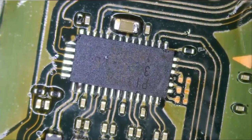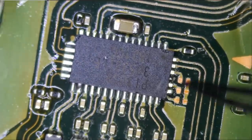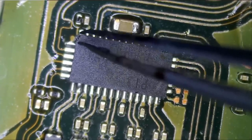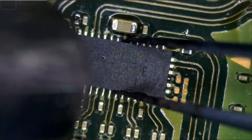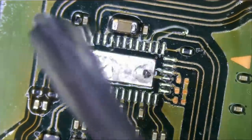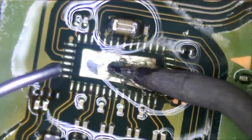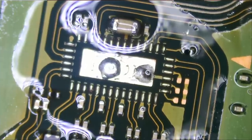Let's go over this chip here on the back. You can see the chip is not aligned — look at how short the pins are from here versus the pads, and look at the empty distance from this side. So the chip is not aligned. We're going to take the chip out, prep the pads, and solder it back on, assuming the chip is in good working condition. Let's add a tiny solder blob in the center and solder that chip back on.